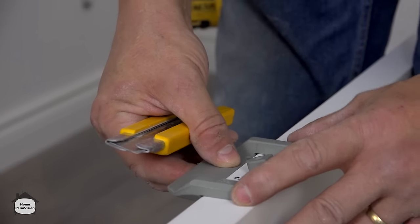The kit also has you chiseling against the grain, which is ridiculous. So this is the painful part of the process: I have a knife, I have it marked, set the chisel on the mark. You have the flat edge and the beveled edge — put the bevel inside so the outside of your mark is cutting straight down. Give it a little love tap, all around the perimeter. When you're cutting with the grain of the wood like this, it doesn't take any energy at all, so don't hit it too hard or you'll rip a hole in your door.